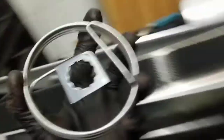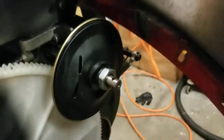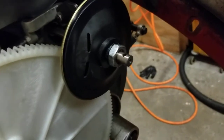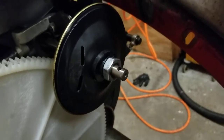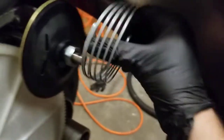The clutch spring set off here does not need to be cleaned. Before you put that on, take your channel lock pliers — with one hand grab the outside of this, just like when loosening it, and give this about a half turn. You don't need it very tight, just snug. You can over-tighten it — under-tightening is not an issue, and I'll show you that in a second. Take this tensioning spring and the first step is to slot the straight part into the black plate.